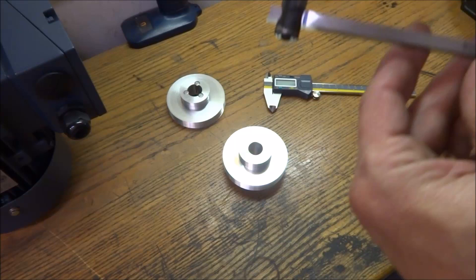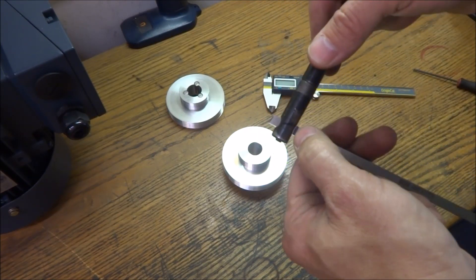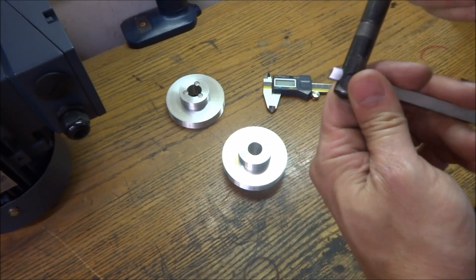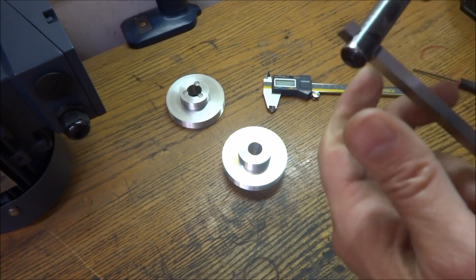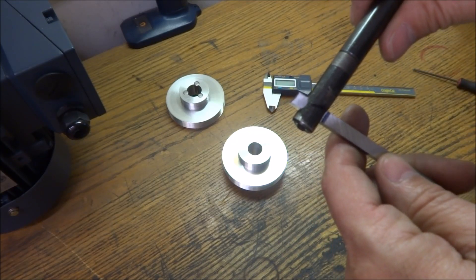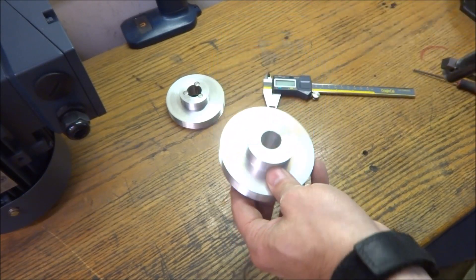You can see how it's kind of going to work here. I've got the stock inside and the set screw in the bottom holding it tight. Then I'll come back and cut this off, but first I want to grind the cutter head — taper the sides a little bit and get a nice angle on the tip. We'll take it to the bench top grinder and grind it down, then come back and cut it off. Then we'll plunge it down through the stock a little bit at a time until we get our keyway slot made.